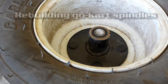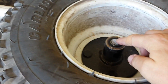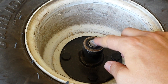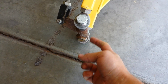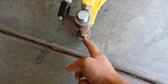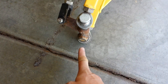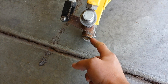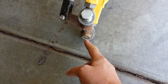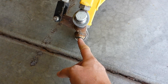Something is always breaking on the go-kart, and this time one of the spindles actually sheared. Look how clean that shear line is — it's right here where it comes off of the hex part that I welded onto the spindle. You can tell it's rusted; I never painted it. It sheared off cleanly, and I'm not sure if that's part of the manufacturing process or if the hex nut is formed in one piece with higher stresses there. This was a grade 5 bolt, so I think I'm going to try a grade 8 bolt.